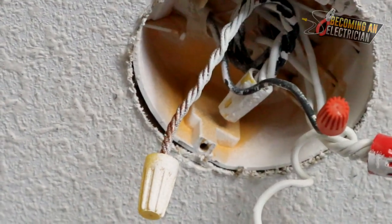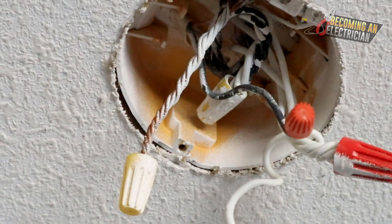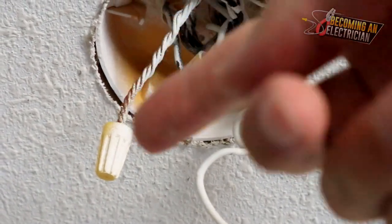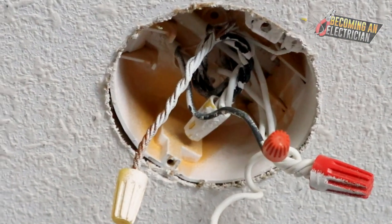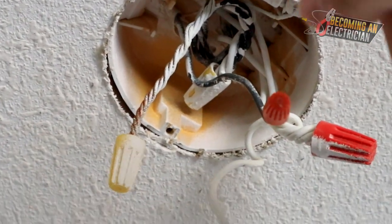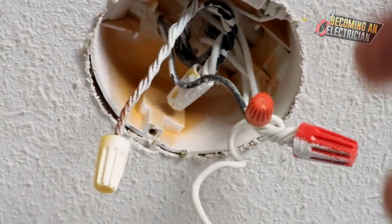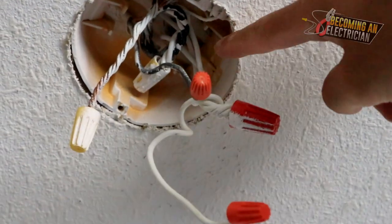Splicing the bond wire all the way up is a nightmare when it comes to renovations. If you ever want to remove a wire, now you have to undo it all. Doing this does not give a better connection — it's just silly. Just make a normal splice, and if you ever want to remove the wire, you just remove it.